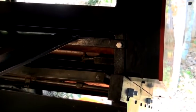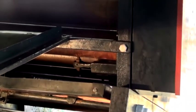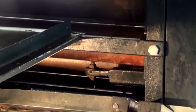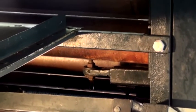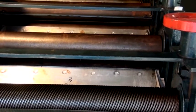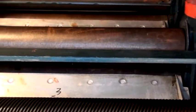If a squeaking sound is detected, it indicates that the aluminum feed trays between rollers are coming in contact with the rollers. The gap between the feed tray assembly and the corresponding rollers will have to be adjusted. Identify the set of rollers which is the source of this sound.